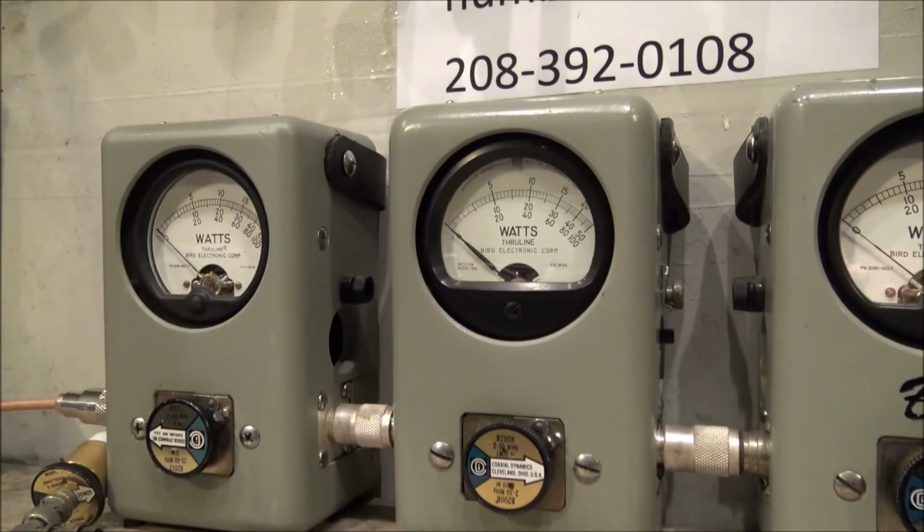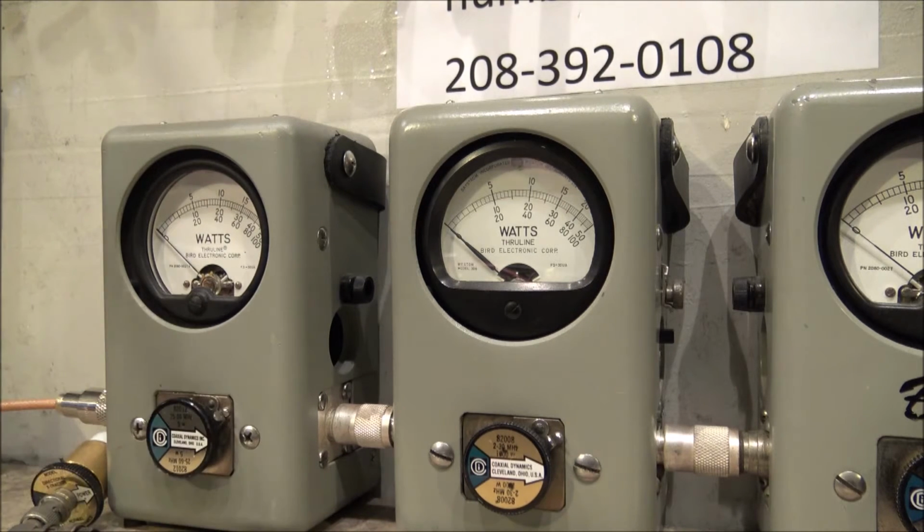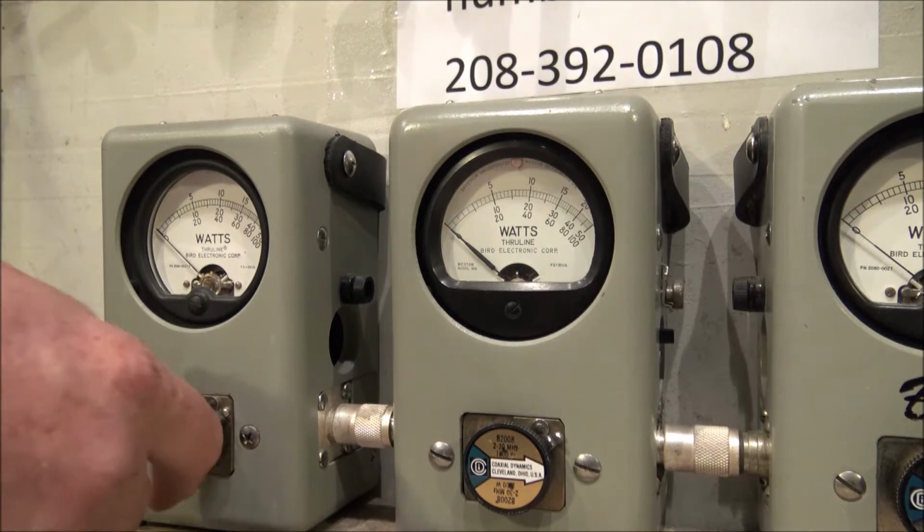Well, I want to show you how much I've got for a dead carrier. I'm going to shut the amp off. And so this is me actually transmitting right now. Check this out. It's a 5-watt slug, so we're going to turn that around and make it so it reads forward. 0.5 watt carrier. I'm going to scooch it up to a whole watt. And I want you to see how much you're going to be throwing for a dead carrier now.